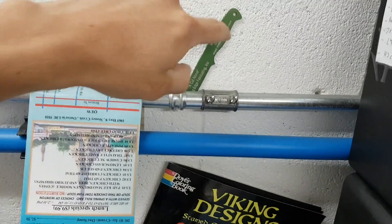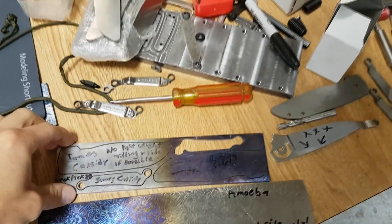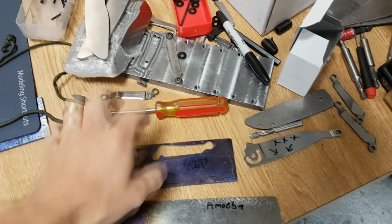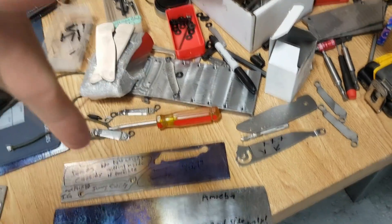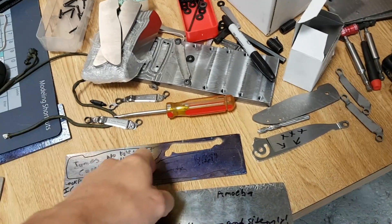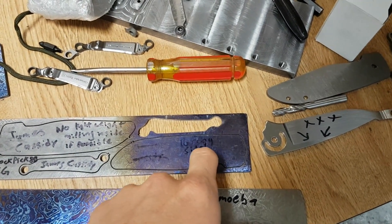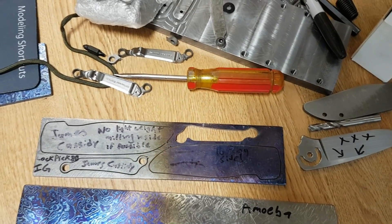Super cool little waterjet aluminum knife blank — he gives those away at Blade Show. He's really good. I think he'll take a thick piece of steel, cut out a square that the piece can pop right into. He's got a five-axis waterjet. Normally waterjet leaves a taper, a draft angle on the parts, but his machine is very good so he can take out that taper and get close to the edge without popping through. Leaves just one tiny little tab.